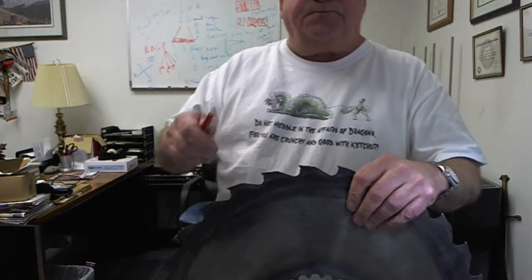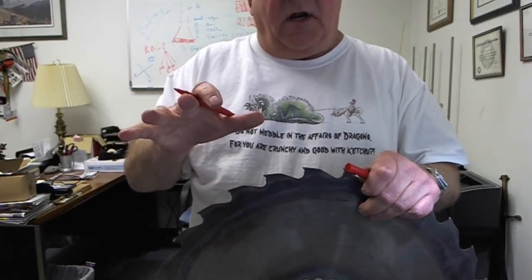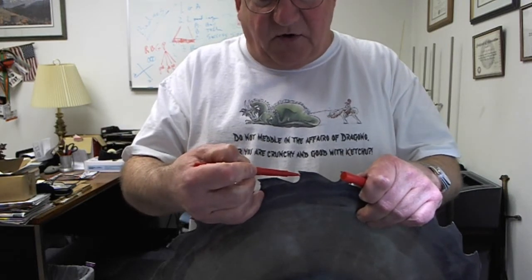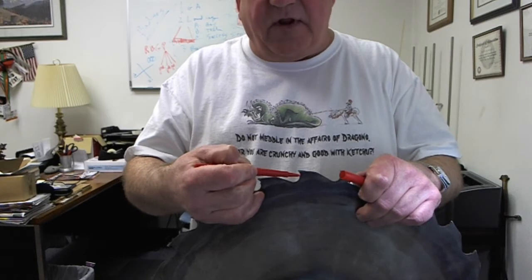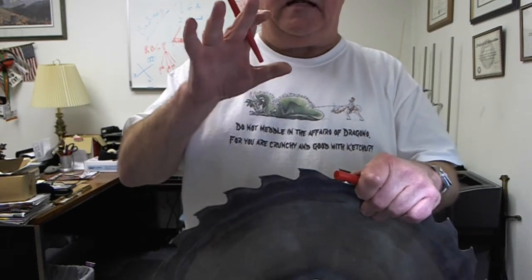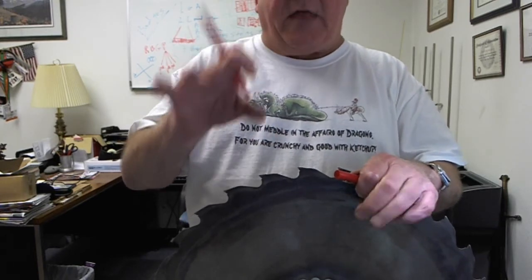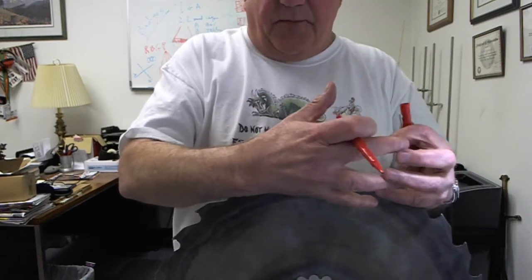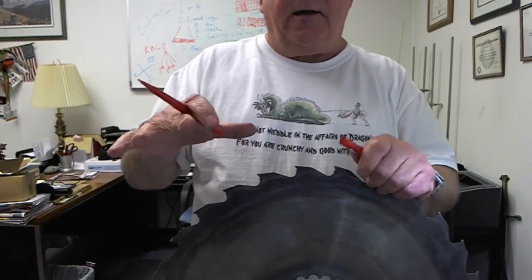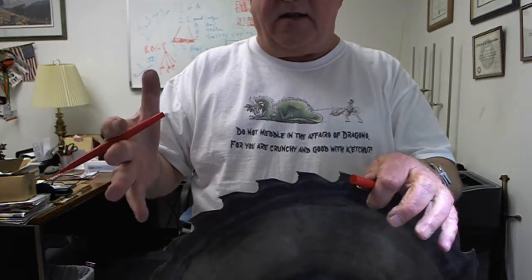What you want to do is put a pre-tin tip from Carbide Processors in here. You heat through the carbide, through the braze alloy, and you heat as little of the steel as you can. The reason is that the steel you heat is going to get hard and brittle at brazing temperatures. If you don't do it right, you get a cold joint, and typically it stays on until you run it — then it comes off.